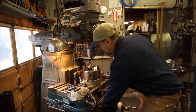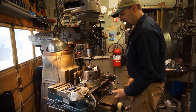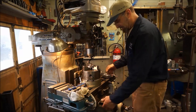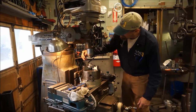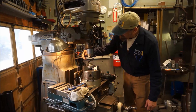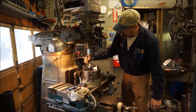Then I go ahead and I tighten up the knee, because each of these joints of the machine itself on an old dog like this, they're loose and you're hanging loose. And so you crimp them and tighten them on up, and you bring it on up. And what you end up doing is you end up moving a little bit. Whereas it was plus five, we're at zero now. See that the knee and tightening everything up actually pivoted everything up this way here.